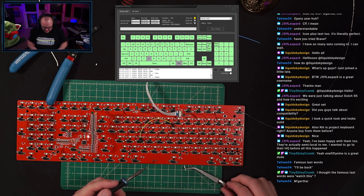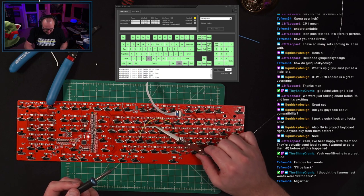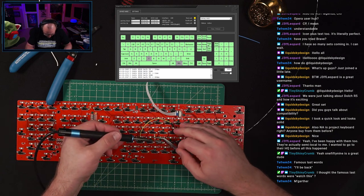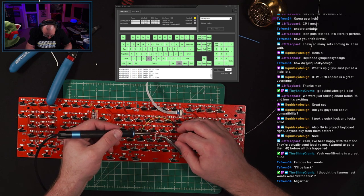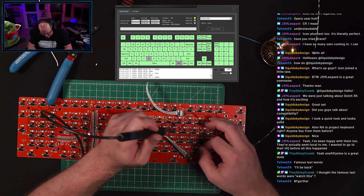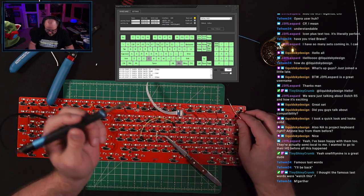So anyway, what we're gonna do is tin these little tips right here, right? You see the little tiny wire, it's real hard. The contrast is not super high. There it is, it's a little better. So we're literally gonna tin the tip of our iron, hold heat on there, tin the wire. Tin this wire. Bring that off, right? The important thing we're gonna do here is retin this. The reason we're doing that is because there's already some lead free solder on there, which is maybe not the best thing ever to do. So we retinned that one.